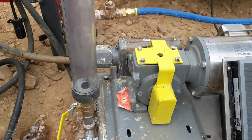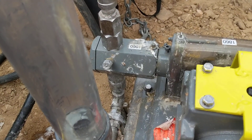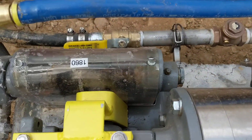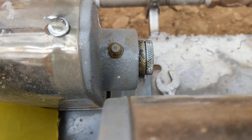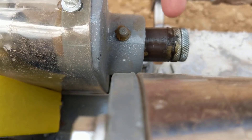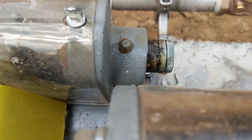We get really high repeatability with this piston pump. Typically it's just a linear proportion to the percent speed versus the max capacity of the pump. This pump has got two adjustable features. First is the stroke length — this one we have maxed out. To adjust the stroke you just turn this nut here and then use the second nut to lock it. This is something you'll want to check periodically; it can loosen up if you don't tighten it properly.